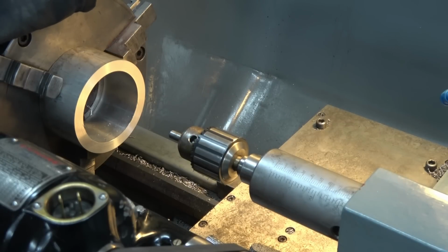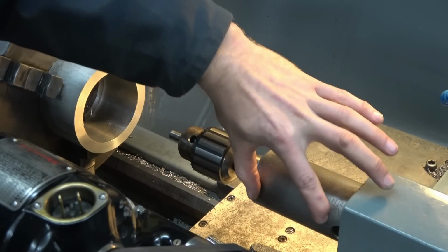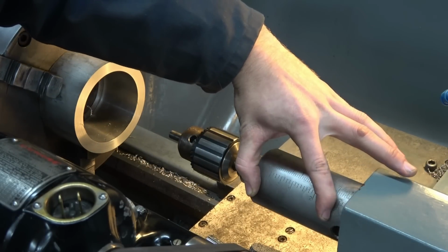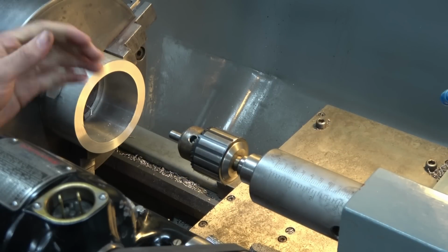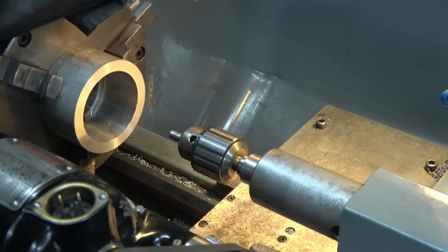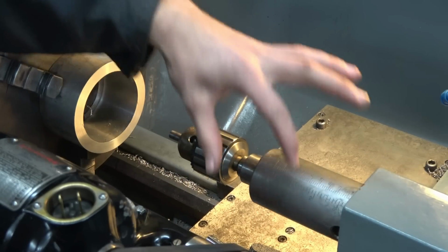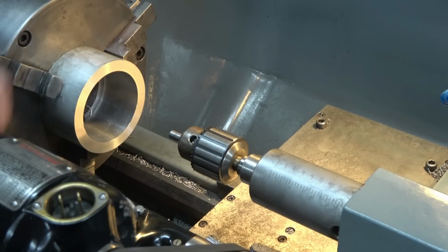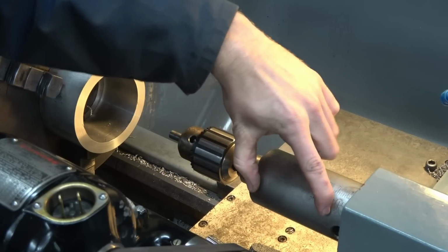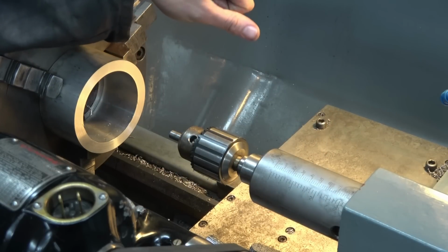However, one big thing to mention in all of this, whether you work off here or here, you're probably clocking across 100mm, 4 inches, and the actual taper I'm going to be machining, and even the top slide travel, is considerably less than that. So even if you can only get within a thou over whatever method you pick, the taper is probably going to be smaller than that. In the case of the one I'm doing, it's about 14mm long, so it's significantly smaller, therefore the error is significantly less as actually exists on the surface.